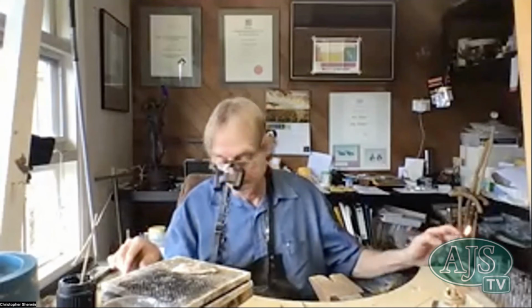Yeah, Chris, just on resizing. Oh, we have a comment here from Deborah. Is there any situation where you would remove the stone? Absolutely. So I guess to finish off on Maria's question, would I anneal the band? Well, if I thought the band was under a huge amount of tension and I was going to cut through and I had to add metal, I would probably, yes, anneal the band as close to the stones as I could.